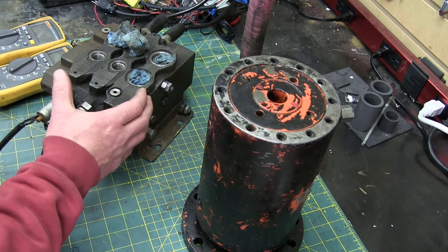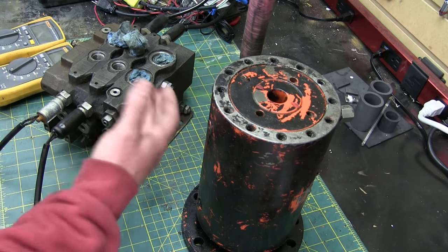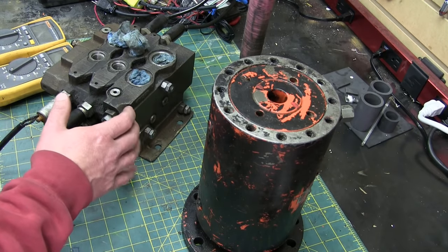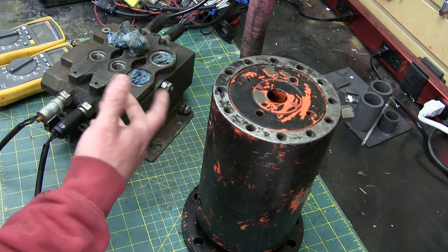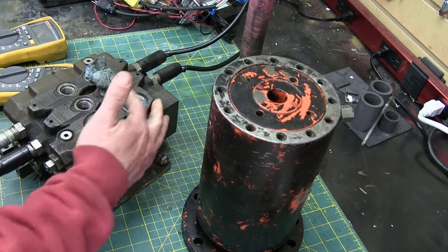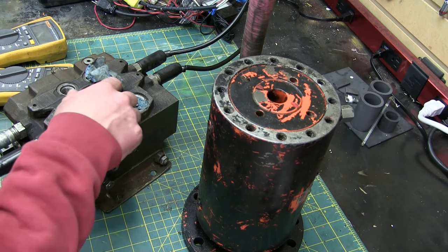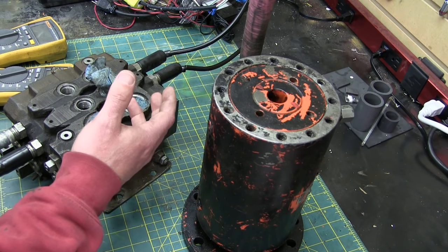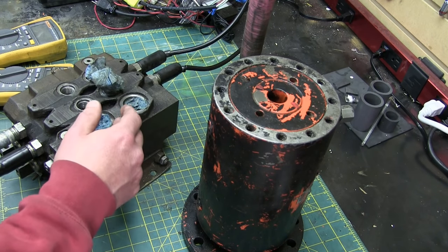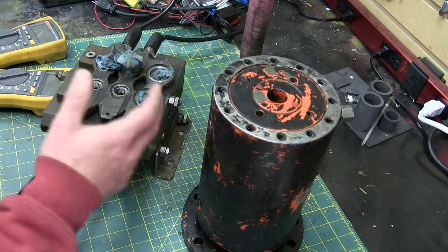I got a call out — thank you very much, Bad Pit. I've been asking you guys, hey, if there's a piece of scrap proportional valve, keep me in mind. And this came out of a basket case mill in Tennessee that closed down — probably moved it to Indonesia. This is a proportional valve. It is closed center and my pump is a gear pump, so it has to be open center. But what we'll do is we'll just let it scream over the relief. I'll maybe do a teardown on this and explain all that hydraulic terminology in detail. It's not exactly the right kind of valve, but we can cobble it together.